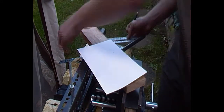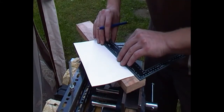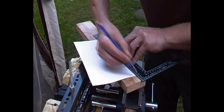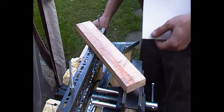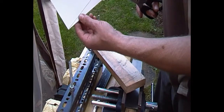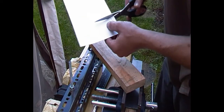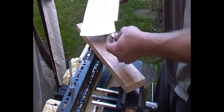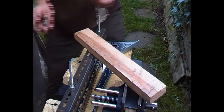Mark up 11 degrees — which is half of 22 — then join that line up with the corner. That gives you your baseline. The easiest way to transfer that angle to the jig is simply to cut out a section of that card. You just need a small section of it — the stiffer the card the more accurate and useful it will be. That gives you your 11-degree bevel: this little triangle.